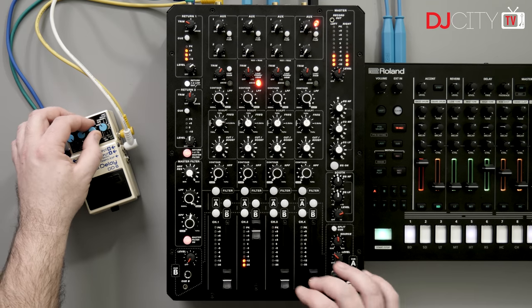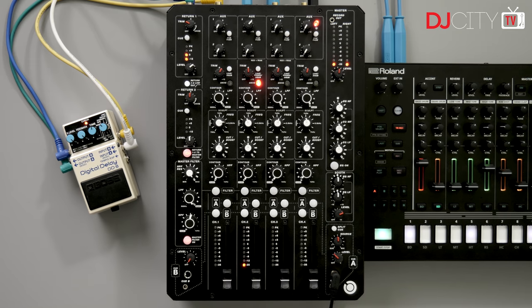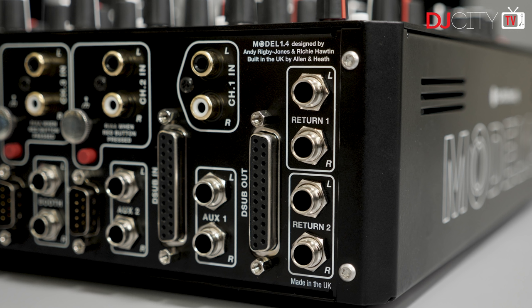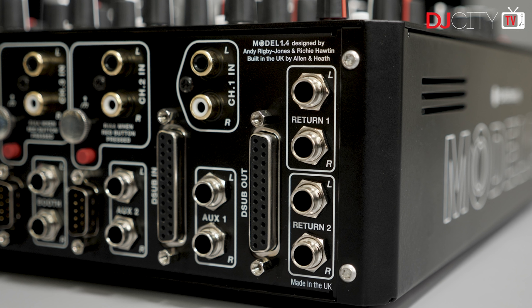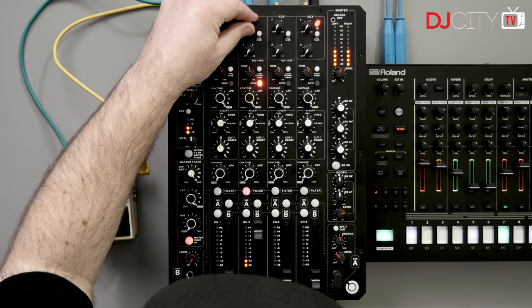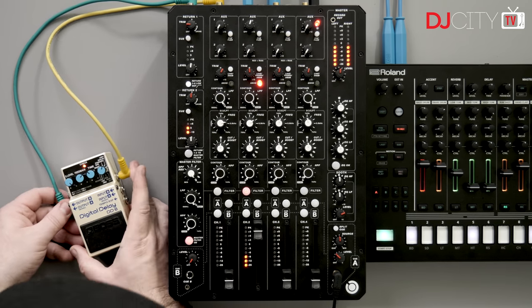The performance buttons are all zero crossing, which means you can slam things like the filter and master EQ on or off with no noise, and that's much appreciated. The VU meters are bright and clear, as are all the LEDs on those buttons. I love the knob to adjust the overall brightness of the LEDs, and having all the knobs being different shapes, sizes, and colors depending on function means the mixer is very easy to use in a dark room. It's worth pointing out that, unlike the vast majority of send-return systems I've encountered, the AUX sends are both stereo only. If you plug a mono guitar pedal into the left channel only, you're just getting signal on one channel. They're balanced too, so levels might be an issue with some hardware.